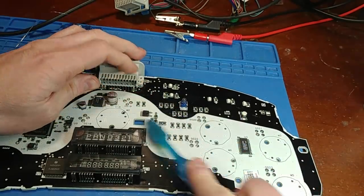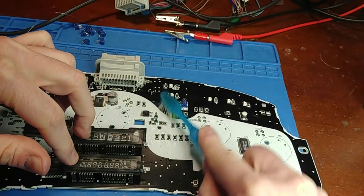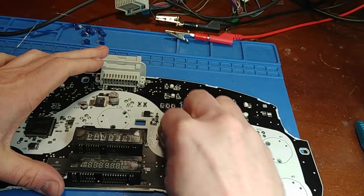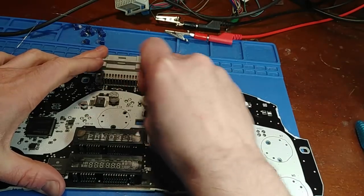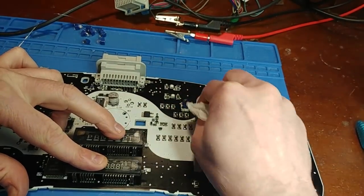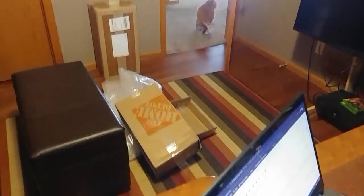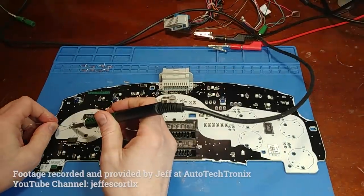These resistors here are responsible for the vacuum fluorescent display hot-wire circuit. They pull a continuous current, but over time mixed with heating and cooling and vibration and all the fun automotive stuff, they will eventually fracture. As they fracture you would notice your displays getting dimmer and dimmer over time. By getting some nice leaded solder in here that will prevent that from happening. Let's get these new lamps mounted.